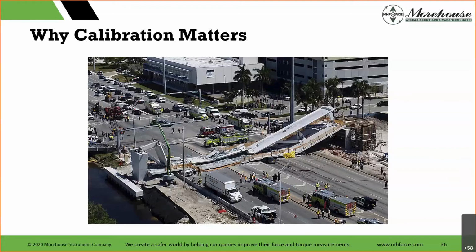You go to work every day. Maybe the load cells, the transducers, the other equipment you see are used for some of these tests. What happens, right, if you don't get the hardness of that adapter right? What happens if that has an additional 0.3% error? They go to do a test, one of the stress tests. Again, they're thinking they're within 0.25. They're measuring, they're doing their uncertainty, they're propagating it. They might be calculating the risk. They're assuming really, really low numbers when in actuality, they're out by 10 times, putting out something that's 10 times higher or more than what they think. So really important on the lab level. This is called global consumer's risk, and it's very important on your lab level to evaluate your calibration suppliers, make sure you're getting what you need, make sure they're calculating uncertainties correctly, making sure they're doing the appropriate risk analysis, using the right adapters, which isn't covered in any standard.